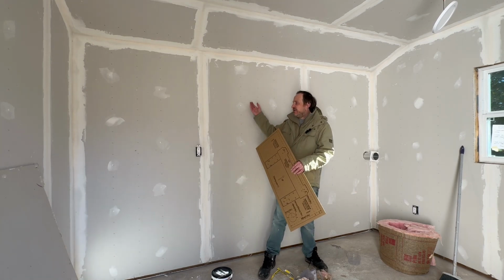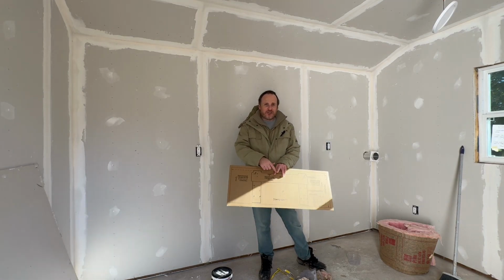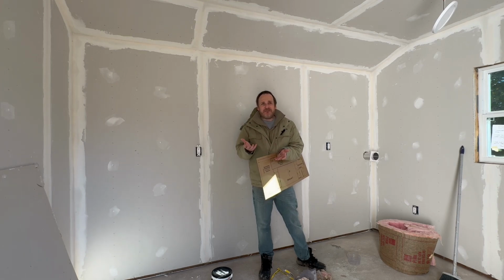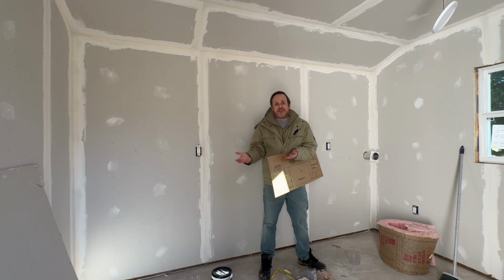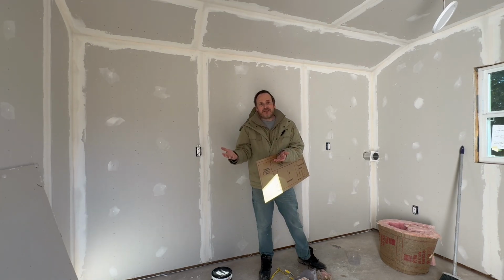I thought you just slap it on the wall, run a couple of cables through, have an electrician hook it up, you're good to go. No, you've got to charge this thing with the air conditioning unit. You've got to have a separate dedicated line. There's a ton of wiring involved, more than probably the average homeowner could do. So average installation is about $1,000, but you need a dedicated circuit. So to run a circuit from the box in the house to the shed is another $1,000.